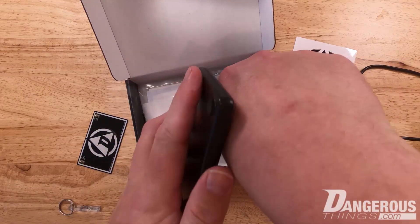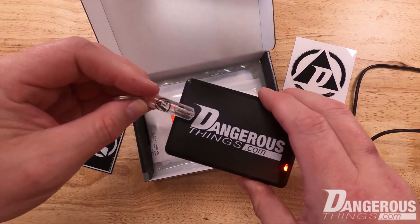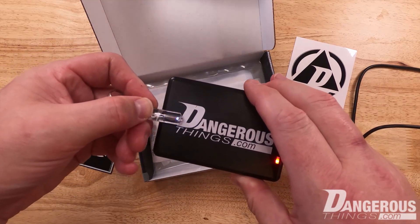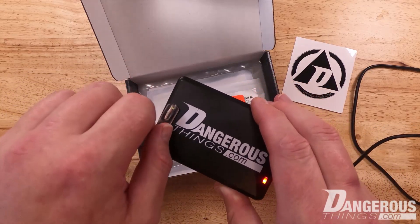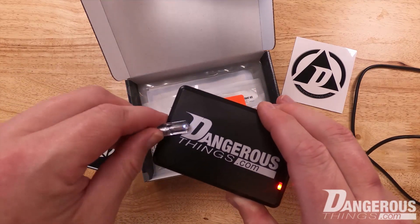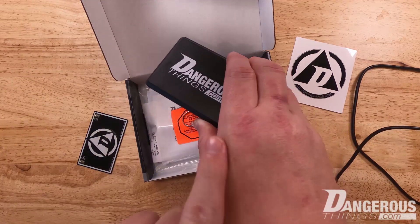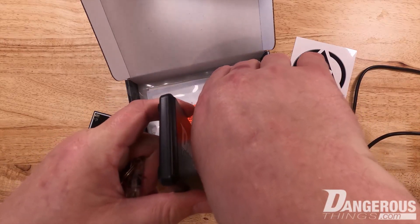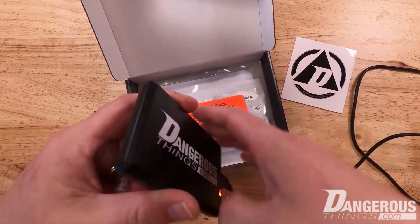I have an implant here, I'll show you. The important thing to note is that orientation does matter with cylindrical shaped implants, because to get the best read you need to be perpendicular to that antenna alignment. So if I rotate this, you'll see the LED doesn't do anything. But if I turn it even 45 degrees, you get a signal. Clearly the strongest signal is exactly perpendicular, and the same is true for an implant. If I present my implant — which is parallel to my metacarpal bone in this direction — it does get a read, but if I turn it, it gets that read much more readily.